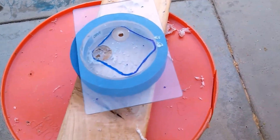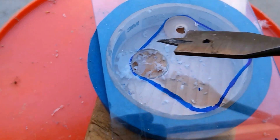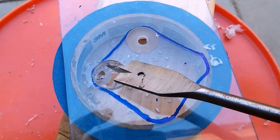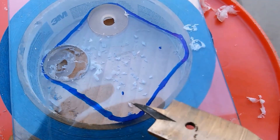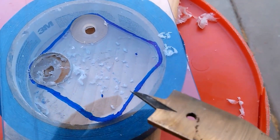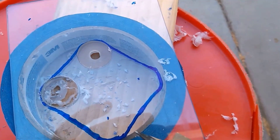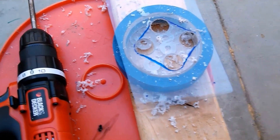I went out to my side yard and I'm using this — I think it's three quarters — it's working pretty good. I kind of do it halfway on this side, then flip it over and do it through the other side. Then I'm going to take my jigsaw and connect the dots, then take a file or maybe my dremel — probably a file depending on how much I have to take off — and clean it up to see if we can slip our water block into there. I got all four of them done.